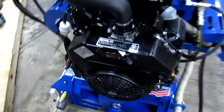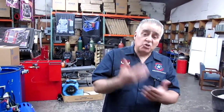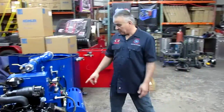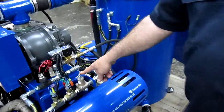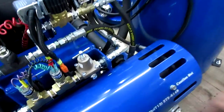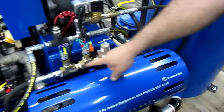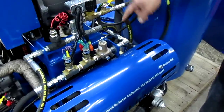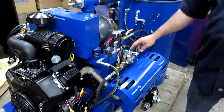If we've checked those and we still have low pressure at the machine, these machines operate with water. If they don't get enough water, they will not have enough pressure to build up. One of the first areas to check will be your incoming water regulator, which is used on our machine to help the pump inject chemical. With vibration, this handle may have come all the way loose to the point that it will not allow enough water to pass through for the machine to pressurize.